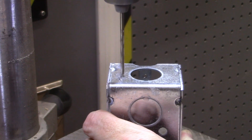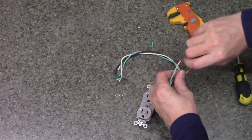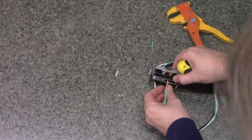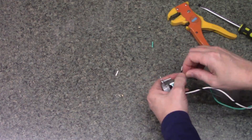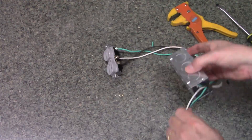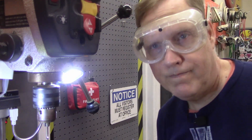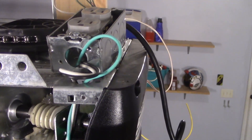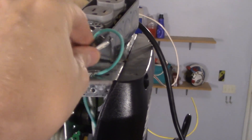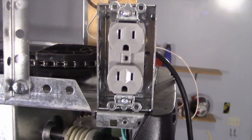Matching holes are drilled into the junction box, and you can see I've already punched out the access hole that the wire is going to go through into the box. Wires are harvested from an old extension cord that we keep around for exactly this purpose, and those wires are used to connect the receptacle that will be mounted to the top of the garage door opener. I'm doing it down here on the workbench because it's a lot easier than up in the air. Off camera, I use this bit to drill the hole that the wires are going to go through on the garage door opener. Then I feed the wires into that hole, and the receptacle goes on very easily, sitting on top of those pre-drilled holes.